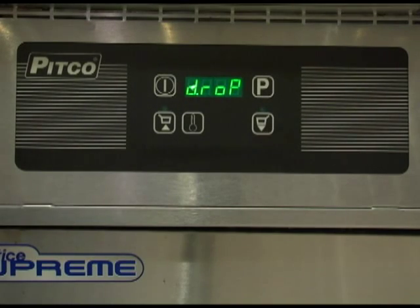The indicator light above the left side timer will illuminate and the display will show the current timer setting for that timer. Using the up and down keys, you can adjust the timer in five-second increments. Once the timer is set correctly, press the program key to save. Then set the right side timer in the same manner.